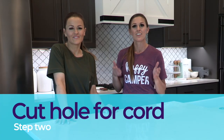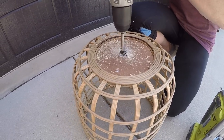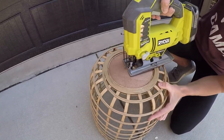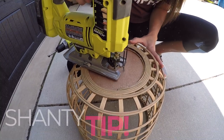Now we're taking it outside and we're going to cut a circle with our jigsaw. First, we're using our Forstner bit and drilling a hole into the center of that circle. Then we use the jigsaw to cut the full circle out — and that's a great tip: if you're cutting the center out of a piece, you want to make sure you drill a pilot hole that's big enough for that jigsaw blade to fit inside of.